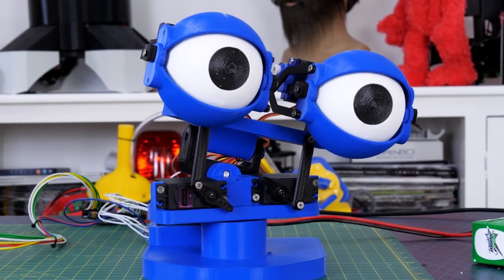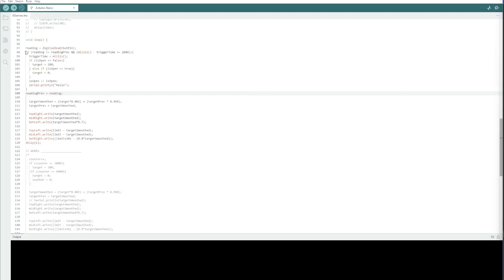I also needed to add some code to prevent the button from triggering twice in quick succession, so I made a piece of code which checks the current time and subtracts the last time the switch was triggered, and if the remainder is too low then it won't change state. If you want to see more of the final result then check out Little Empress on Instagram and TikTok — link will be in the description.